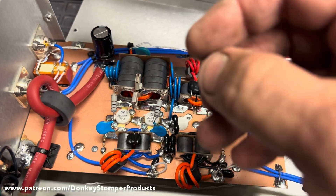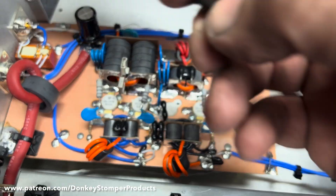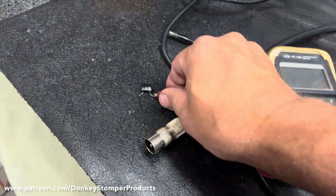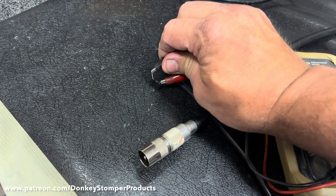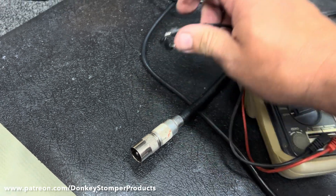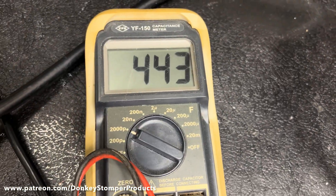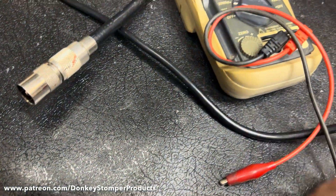I had put this in there intending to run a test myself to see how long it lasted, but it didn't make it. So I can show you guys: to any builders out there, the 500-volt 1000-puff silver mica will not hold on the two-pill section. It had degraded down to 443 puff — just a note to amp builders, this might help you.